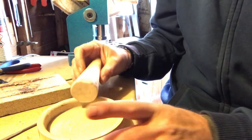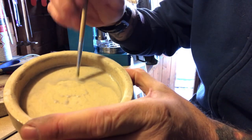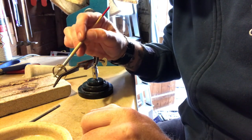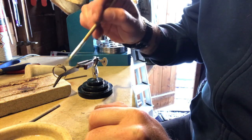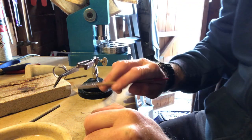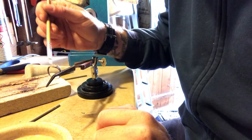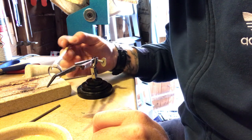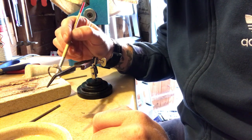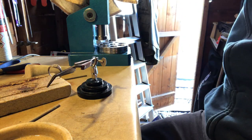That's perfect. Got the borax in there now — look, the grey sludge — that's what's going to stop the oxidisation. Put that over most of the ring. That stops it all going funny when you heat it all up. Mainly in the joint.